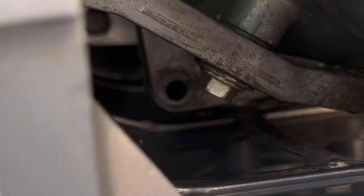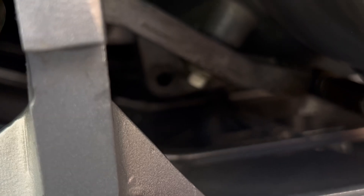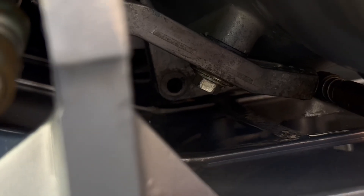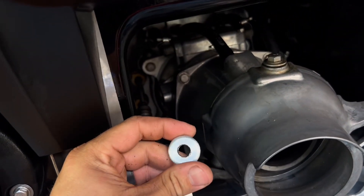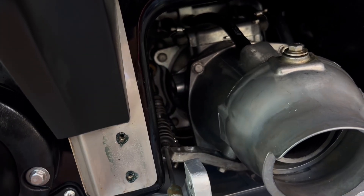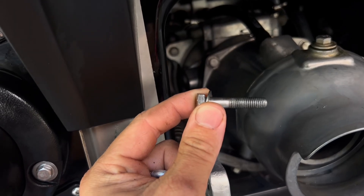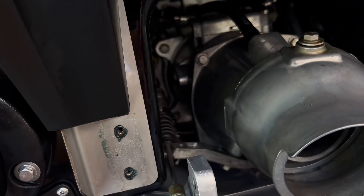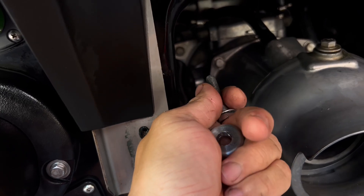This anode is going to have to go right there on the bottom left of the pump. It's going to go right here in the bottom left corner of the pump. This is a 25 millimeter anode, and I drilled the hole out to 3/8 inch so that it accommodates the factory bolt. You will need a slightly longer bolt than the factory bolts to accommodate the extra spacing of this anode.